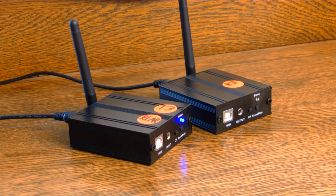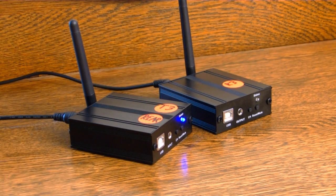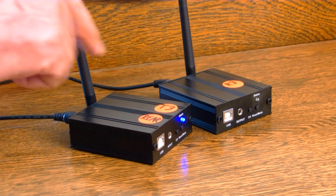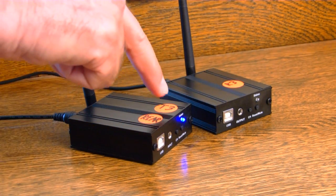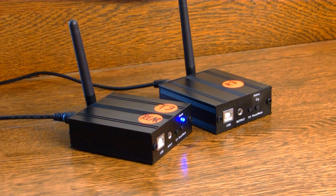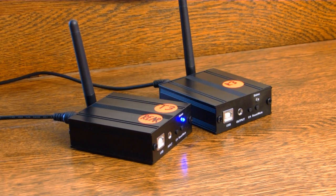If they have turned off, it means that you have this transmitter on the same channel that they are, and you have to then again press the channel button several times until you get a situation when the transmitter light here is on and the receiver lights on your other transceivers are also on, meaning that they are not paired with this transceiver.